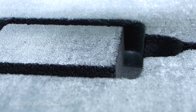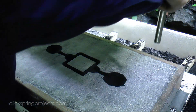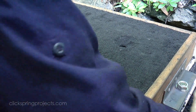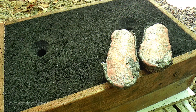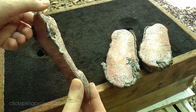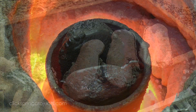As I speculate on the tool technology going forward, this will be the approach that I take with the tool design. If something simple could have done the job, then I'm going to assume that that was the route taken. I'm going to take a similar approach when sourcing the raw materials for the tools. I've made these copper ingots in an open face sand mould using scrap copper, and the tin is also scrap, left over from making the tin lapping discs in a previous video.